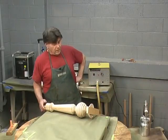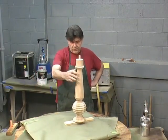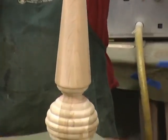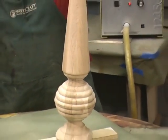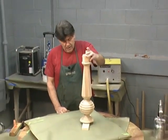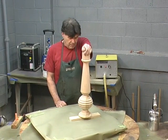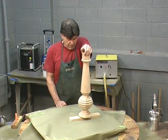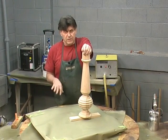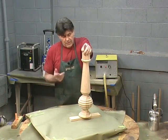We showed you this thing earlier. I don't know exactly what they used it for, but it was a leg or a pedestal or something for a table. Anyway, I told you this is one that was made by a really high-end furniture maker. Now, this obviously would be a candidate in our coloring to make it extremely yellow, stain it, put a top coat on it, and either glaze it or use a toner. Remember where we mix a dye or stain into our top coat to be able to blend it? But that's not what we're doing.